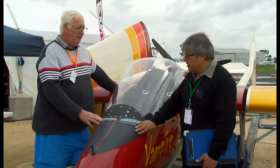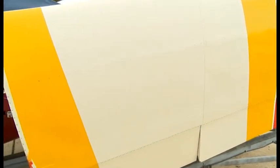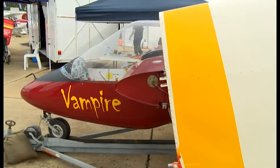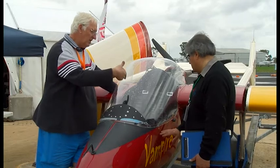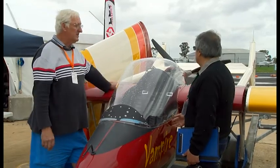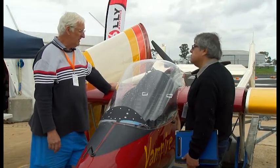Which are the composite parts? To me this looks like all metal construction — all the wings are metal, all the tail boom, all the empennage, everything's metal. The composite parts are the carbon Kevlar pod, and the inner liner is carbon Kevlar as well. The wingtips are basically composite too, but the rest is quite easy to put together — it's pop riveted.